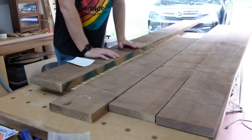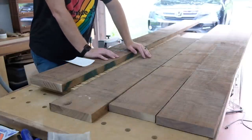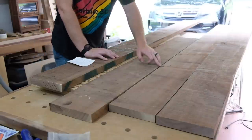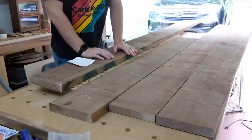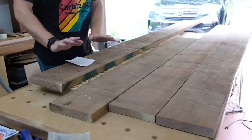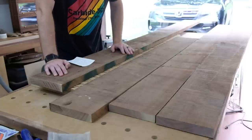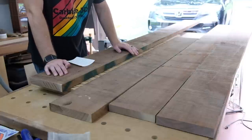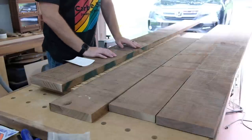My next priority is avoiding knots and defects of that nature. Walnut is always going to have knots somewhere in the boards. If you find a 13-foot piece of walnut that's super clear, congrats, but there's always going to be little knots. I have one here, one here, there's a big one here — there are knots throughout these boards. I'm going to avoid those because I have enough material that's usable in the increments that I need that I don't have to worry about knots. Now if this was a six-foot long cabinet, I probably would just use knots because I wouldn't have a choice. I would just fill it with epoxy and make it look as best as I could. But in this situation I can avoid that, which is a plus.